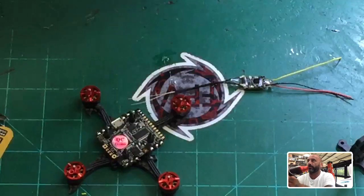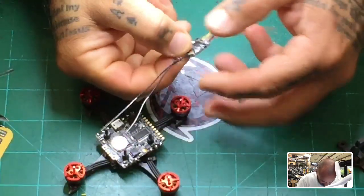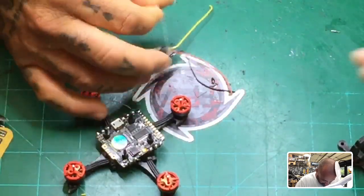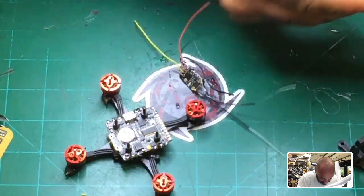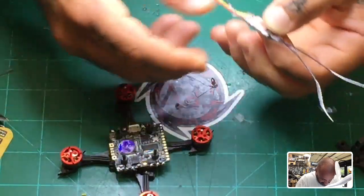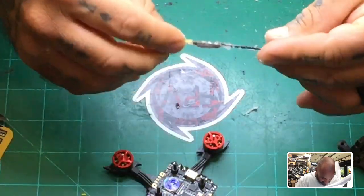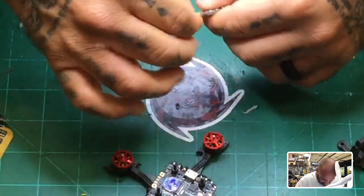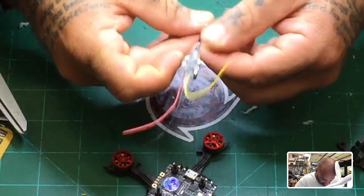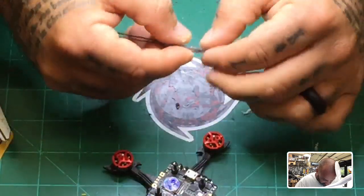And now I'll go in there and squeeze those edges. So I will squeeze the edges now and the glue will just come out. It's hot though. Holy crap, that's hot. But when you get it on, you just rub it off there. It'll make a little mess, and then that's it. Just get rid of the excess strings of glue, and those will disappear. Then you've got a pretty nicely sealed receiver, okay? Once the glue is fully dried and cooled, you can clean it up. There you go, and then these pieces just come off. The good news is you've better secured your antennas from ripping off during flight, during a bad wreck or something, and you've got everything pretty sealed.